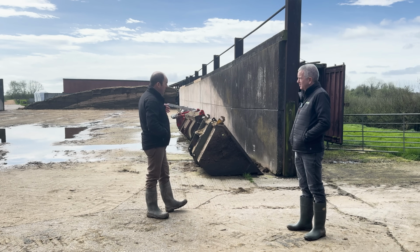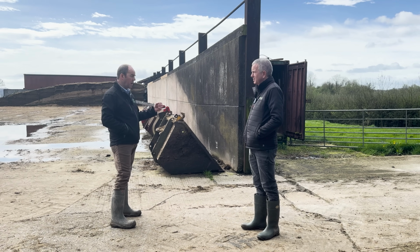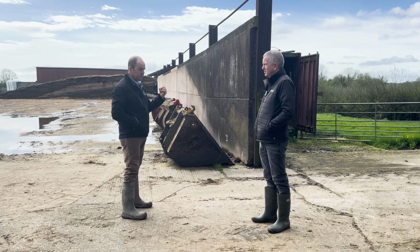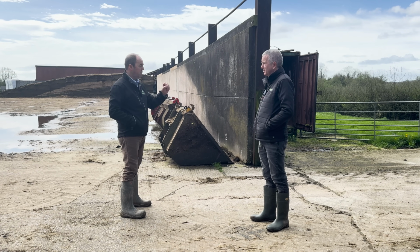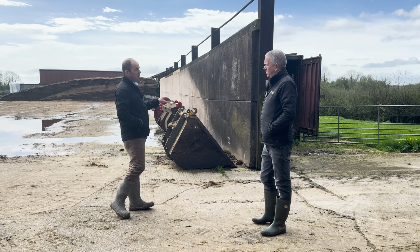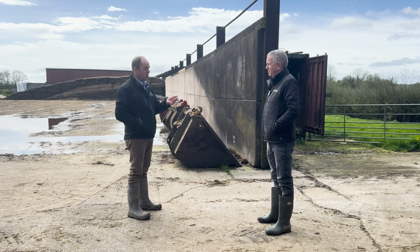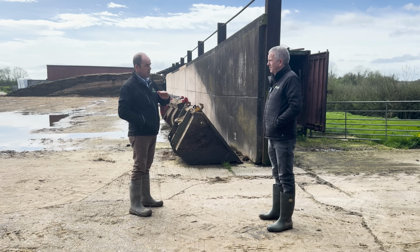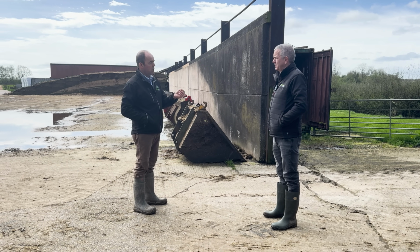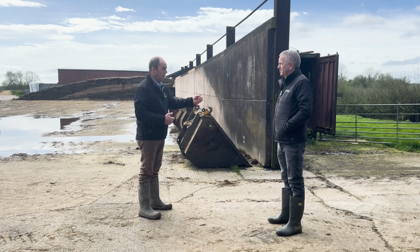Traditionally in this area, we have a mix of concretes. We can either have gravel or we can have limestone. Gravel concrete is fine for concrete yards, for passageways and for yards, but on a silage pit I would always prefer a limestone concrete. Basically the limestone will wear at the same level as the surrounding concrete, so as the loading shovel's pushing into it, you won't get the stones from the gravel coming out of the concrete and then getting into the silage.